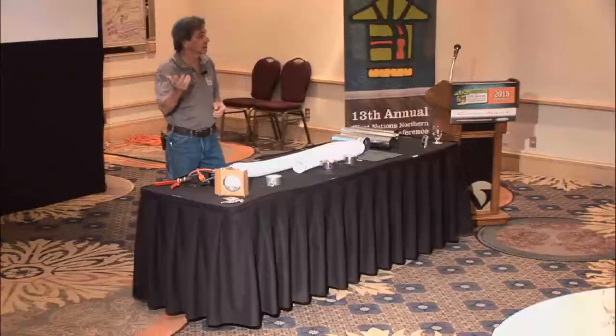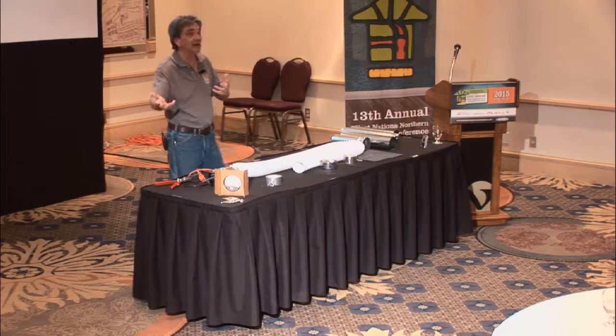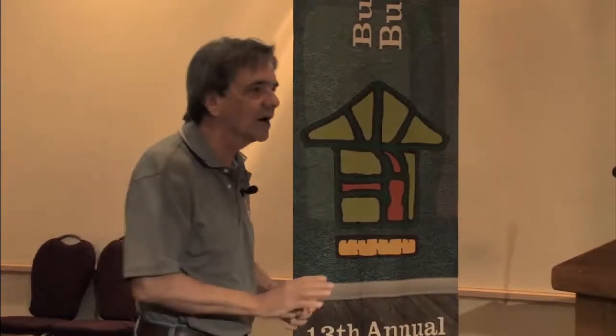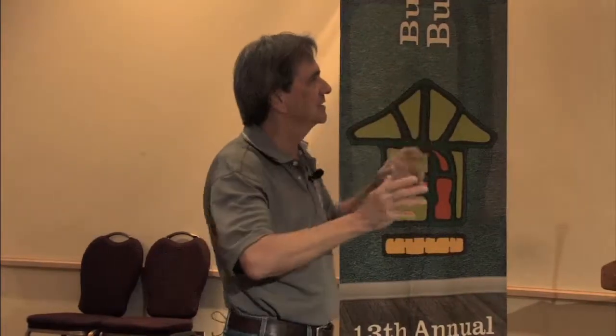And sometimes it's just by extra ducting, you have to plan for it, but you can isolate things, particularly important for people that are on shift jobs and need to live in a different sequence than the rest of the house. And so it allows them to actually function that way. But you can manipulate ventilation if you think about it that way. You don't just have to live with it. And if you get an extreme case, there are insulation materials, soundproofing materials you can put inside ducts to help cut out a particular area and separate that off.